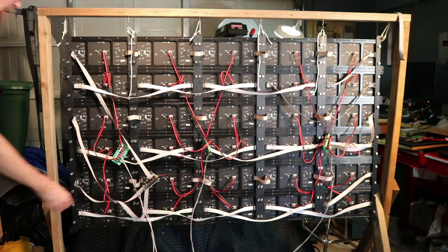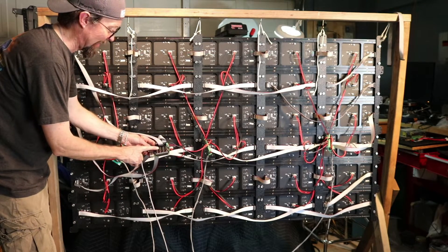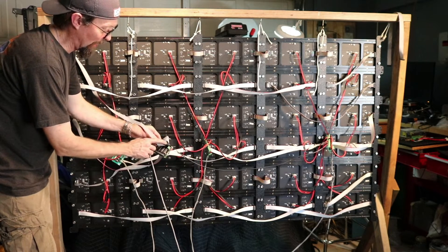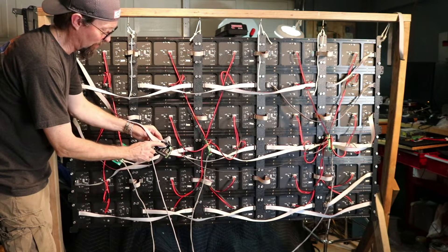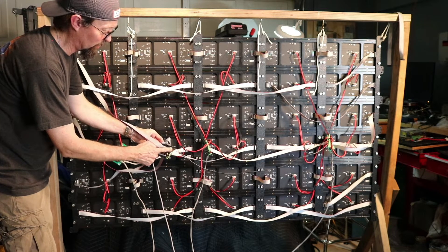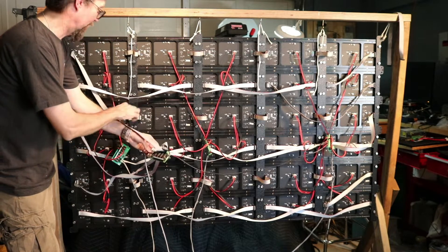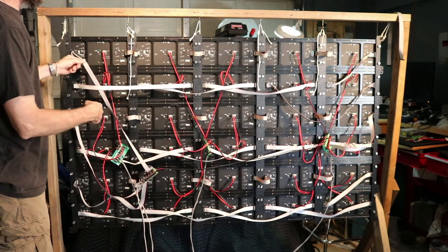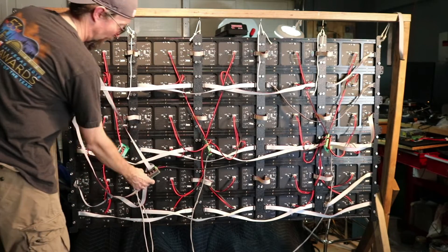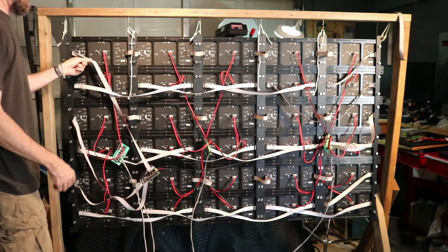Signal flow: I'm running mine off of a Raspberry Pi 3B with the CFOL matrix hat on top. The matrix hat has 5-volt power and three matrix outputs. Number one is the one in the center by itself. Number two is the one over by the RJ45 of the Raspberry Pi. Number three is the one closest to the power pins of the matrix hat. I have 30 panels and three outputs — six rows, so two rows per output. The hat is capable of doing 12 panels per output, and I'm putting 10 on all three outputs to give me my 30 panels.